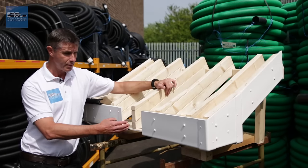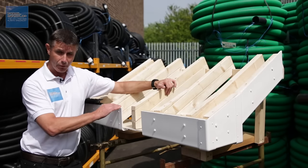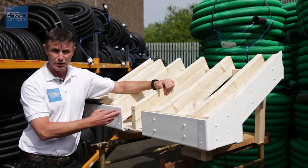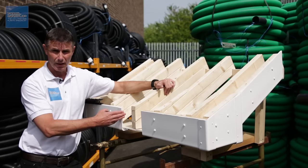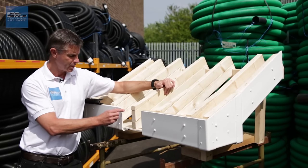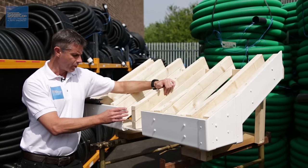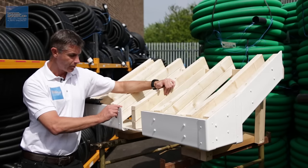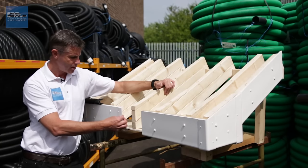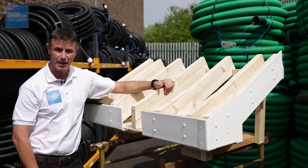The other sections that make up the eaves are section joiners to cover the gap where two fascia boards join, and corner joints at the corners. It's important to recognise that you never butt two boards directly together — you always leave a 10mm gap for expansion, because PVC does expand slightly along its length in warmer conditions. On a summer's day, fascia boards will move about 5mm each, so you should always leave a 10mm gap, which the corner and joiner trims will cover.